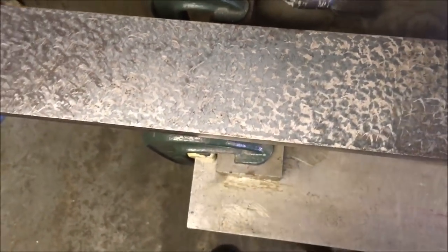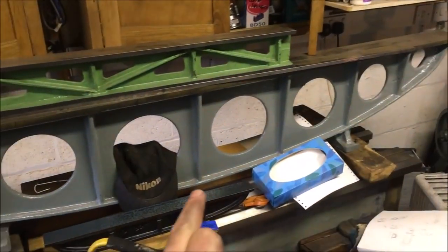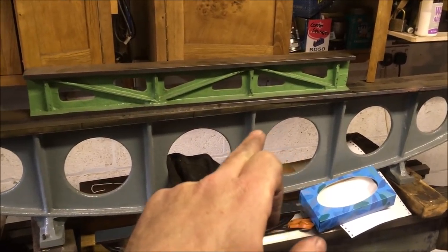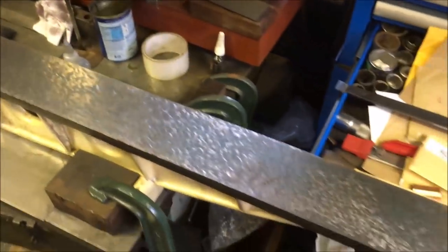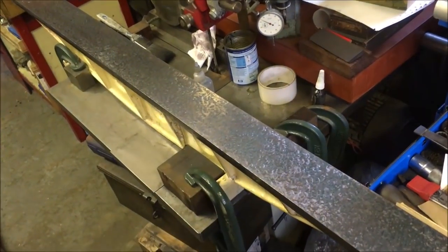But for what I'm doing, where I basically want to be able to use this to make up that one, which is my 6 foot, and then that'll be the master. And I'll bring that surface into high dots per inch, basically using a smaller plate over it, something like that parallel. In fact, I might even use that parallel. So this basically needs to be flat end to end so that I can start getting some registration marks on that other one.